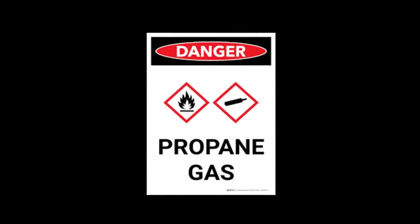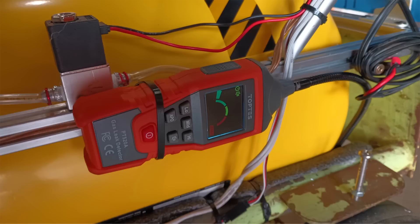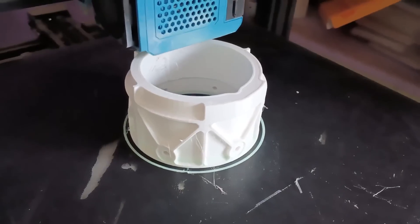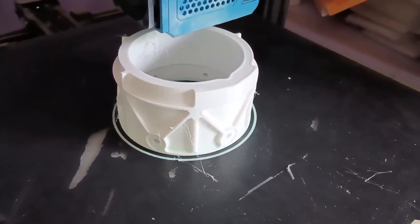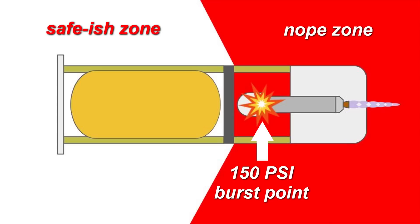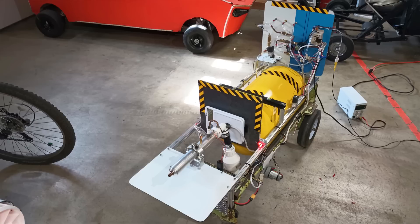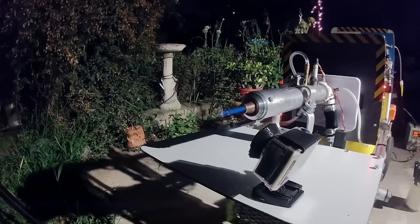Now that I was introducing volatile propane gas to the system, I had to get serious about fluid control and safety precautions. I installed numerous check valves at all connection points, and a flammable gas leak sensor inside the air tank to alert me of dangerous fuel backflow. I also designed an intentional overpressure failure point in the 3D-printed adapter to avoid a more catastrophic detonation. My test stand also has a super thick steel plate shield to hide behind during testing. Once the test stand was finished and the engine installed, I filled the air accumulator and activated the pre-ignition system.